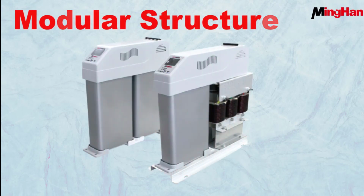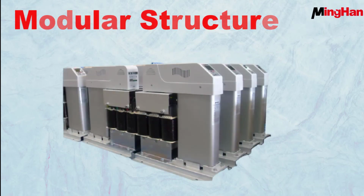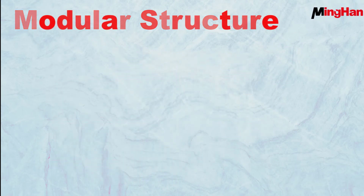Modular structure. The smart capacitor has a modular structure, small size, simple field wiring, and convenient maintenance. Its compact size occupies very less space. Only need to increase the number of modules to realize the expansion of the reactive power compensation system.